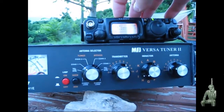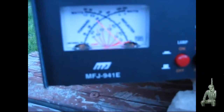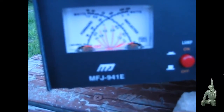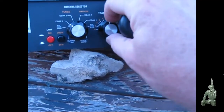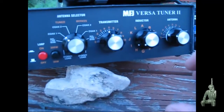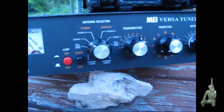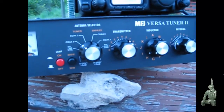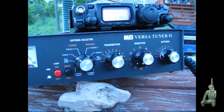I'll put this in FM mode and turn the volume down so you can come over here and see the needle move. We get a full 5 watts out with no reflective power. If I move this knob off a little bit — now I'm getting a little reflective power just by moving that transmitter knob. I'll move that knob back a little bit and look at that — reflective power is gone. So that's showing us that the repair worked and this antenna tuner is serviceable and ready to be placed as a backup antenna tuner in the bug out bag.